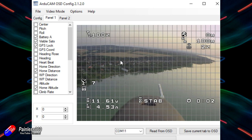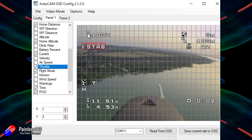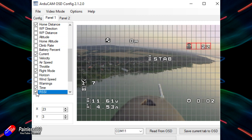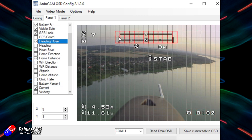I'd always recommend, while you're doing this, just have the OSD powered up with your goggles on so you can make sure you're not pushing anything off the edge of the screen. Unfortunately this on-screen display doesn't allow you to upload different font files, which the older version of the Minim OSD used to allow — that let you put on font files that are a little bit more small and compact, since the default one is a little bit blocky. But it does mean that if you have an old FTDI adapter, you can get into this and change it to work exactly the way you want.